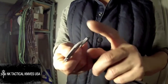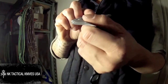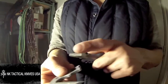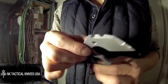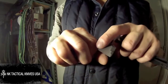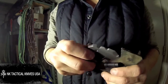That will sharpen it. Because if the back angle is too high, it's going to be more than 40 degrees at that point — very thick. If the back is 20 degrees and you already have this side at roughly 23 degrees as I set it, it's going to be too much. It'll cut flesh, but it won't do so well against cardboard or something. Keep in mind this is a 5mm thick version — I didn't intend this to be a cardboard cutter. The thinner 3mm stock standard versions of the card knife will definitely go through cardboard once it penetrates. I want to add a consistent pattern where the sharpening is on this side, so it gives just enough curvature so that when you slide in, there's less chance of it cutting the sheath.